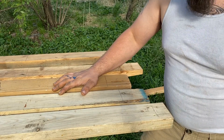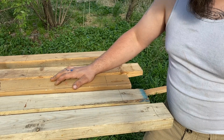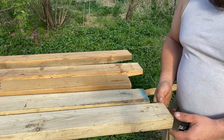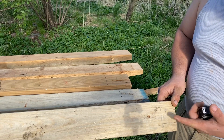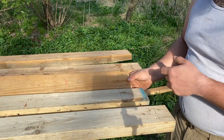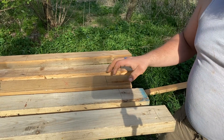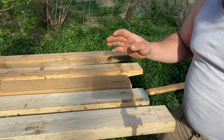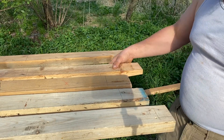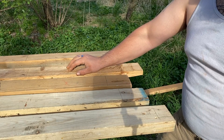Today we're going to be making a barrel boring stand. This is essentially going to be a giant version of the saw horses I make. A couple exceptions: the top plate has a cut out for the handle of my drill, and the middle and bottom sections are having four inches or about 10 centimeters of length cut off so the handle and cord can go down. The legs are 36 inches, or a couple centimeters less than a meter.